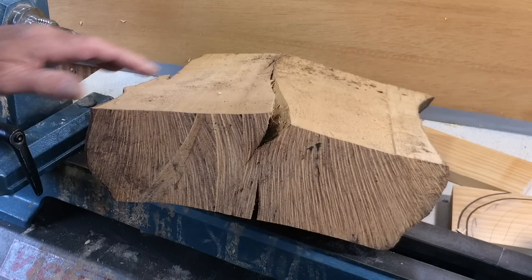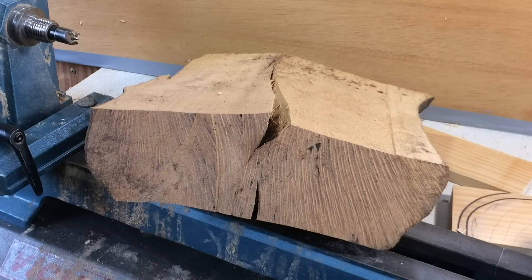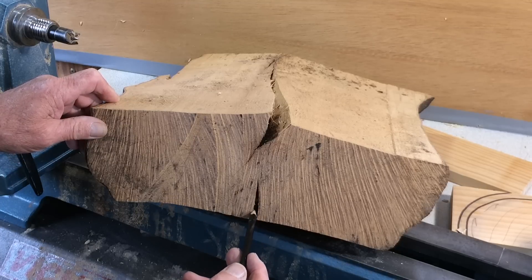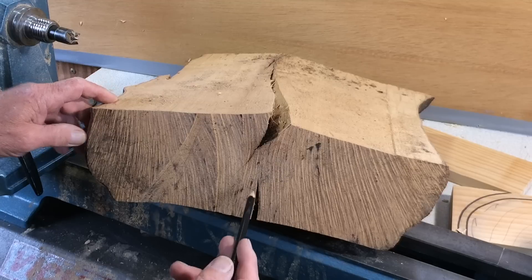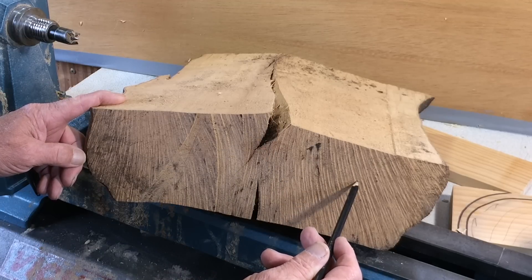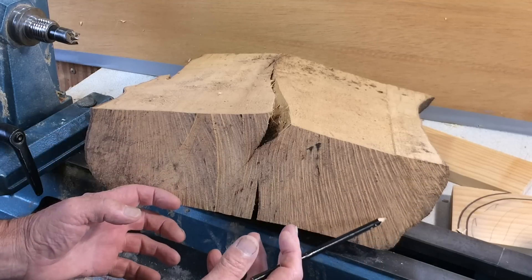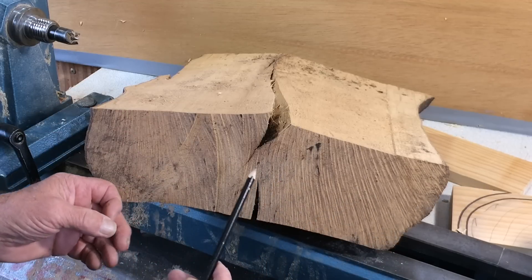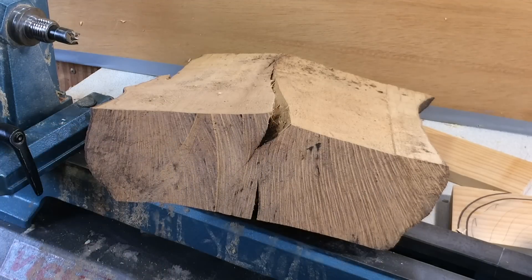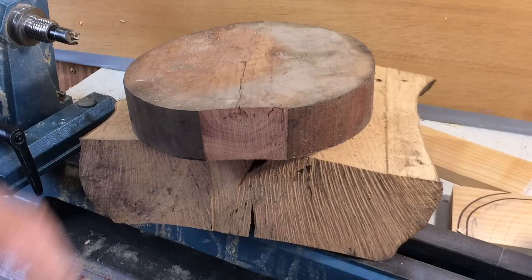This blank was sawn originally for a bowl — both surfaces were flat — and it's a fine example of what a log does as it dries out. This split may well have been there before the board was cut, at least in embryo. This is a bay tree, and as the wider growth rings on the outside dried out, they pulled and shrank the log down, so whenever you cut a log through the pith, as it dries out it's going to do that. We can see the same thing on this log, only to a lesser extent.